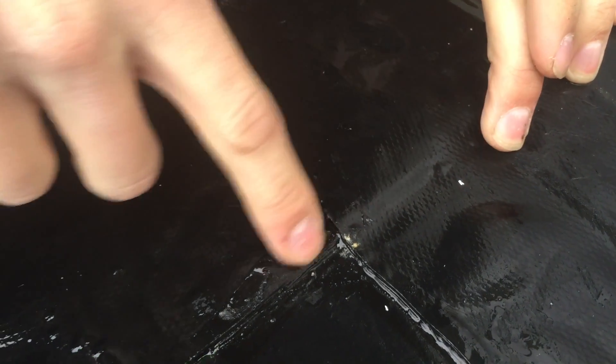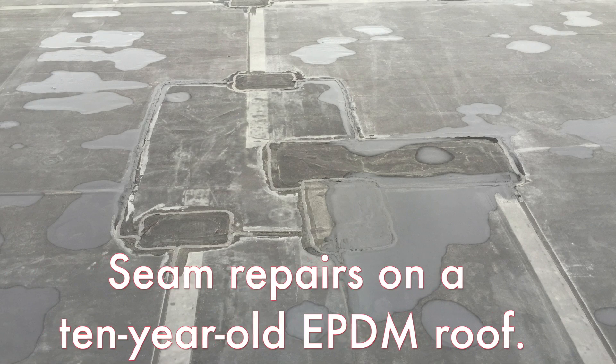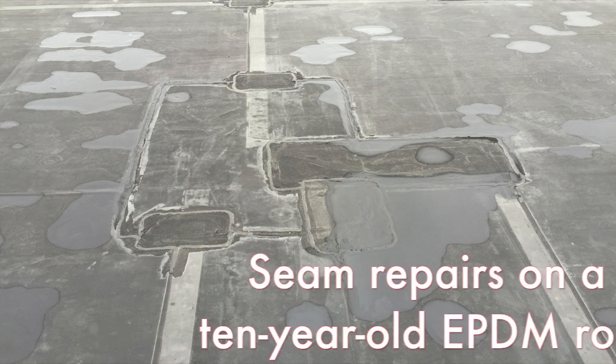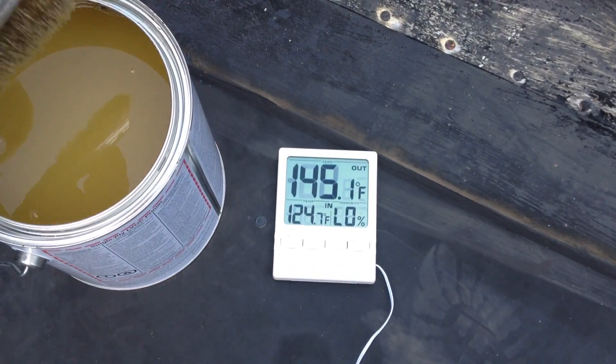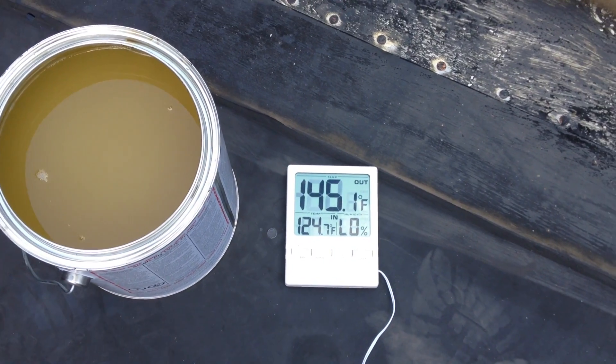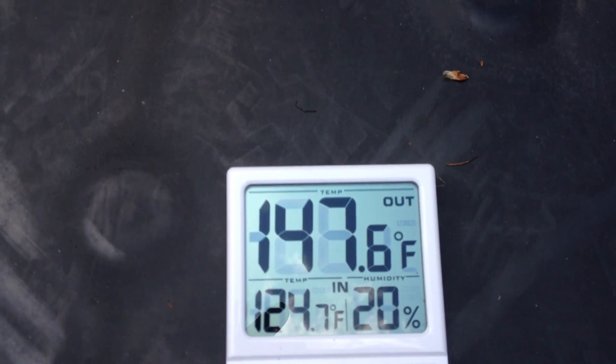I'm going to bring my finger along this seam that's inside the cover tape — just watch here when I bring it along. Look at all that water coming out. The surface preparation can be an added labor cost when removing an old roof system or installing one over a pre-existing one. And lastly, the black color of the membrane absorbs heat and can lead to the superheating of the structure below, causing air conditioning costs to rise significantly.